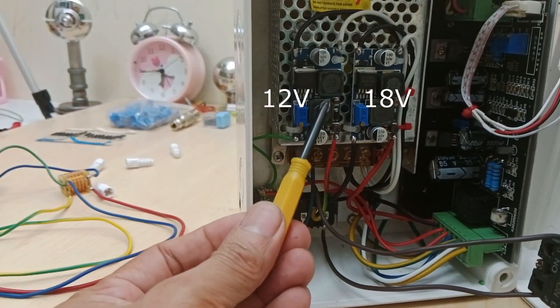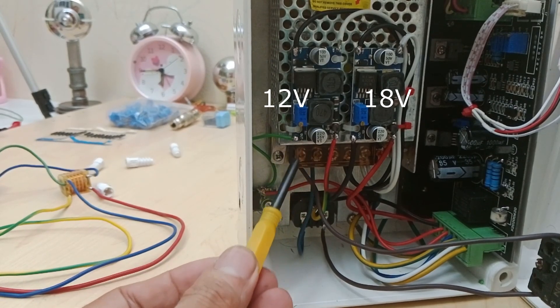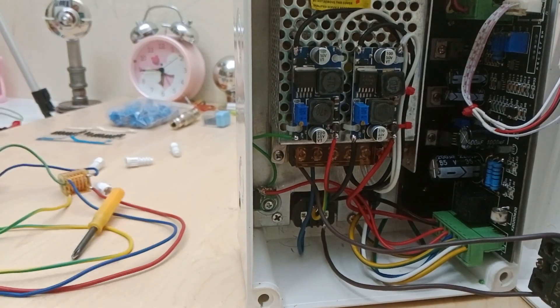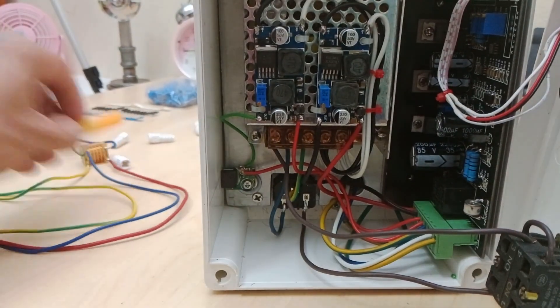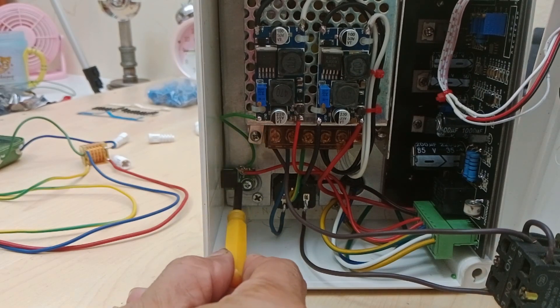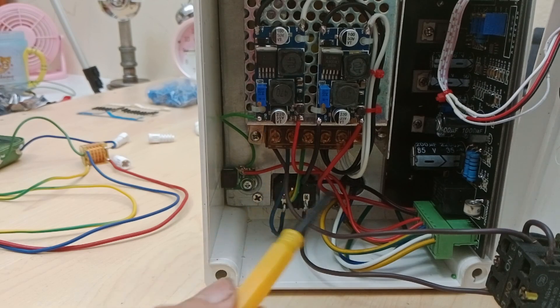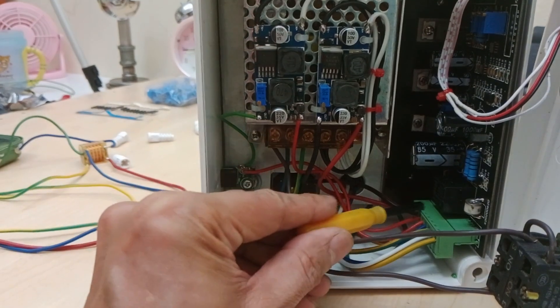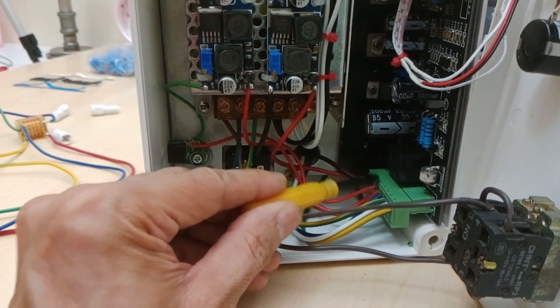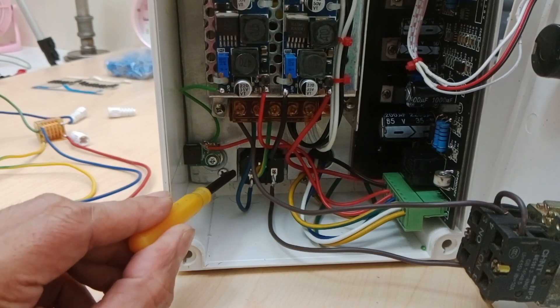The other DC to DC converter is adjusted to 12V. The 12V negative supply is directly wired to the DC jack connector at the side, and the 12V positive line is wired to the relay on the mainboard, which controls the 12V solenoid valves on the air regulators.